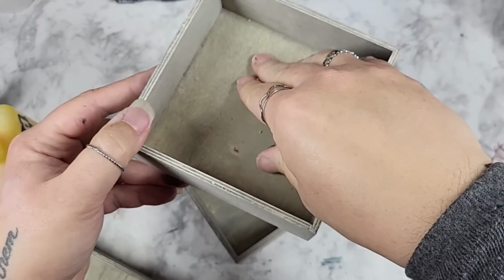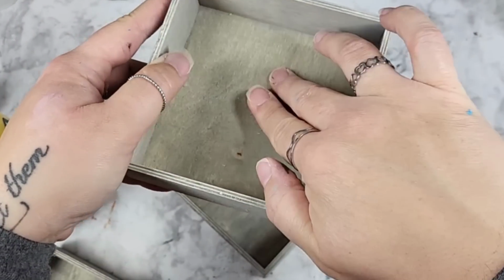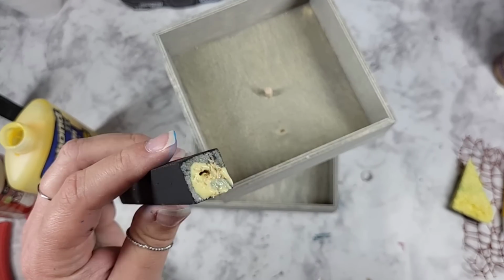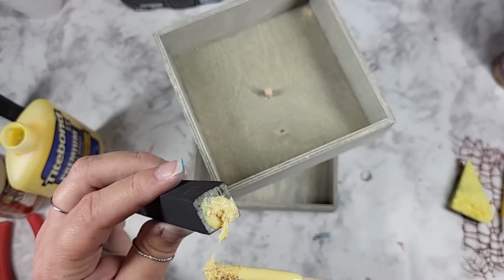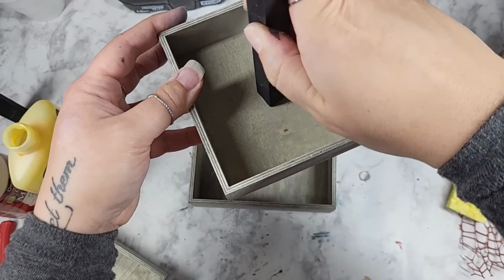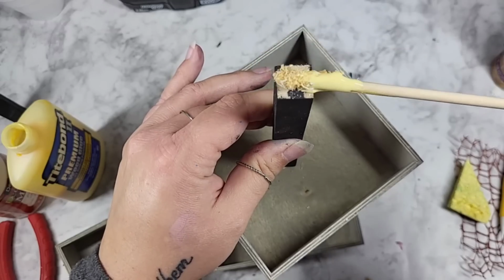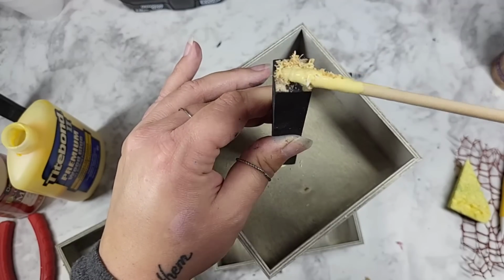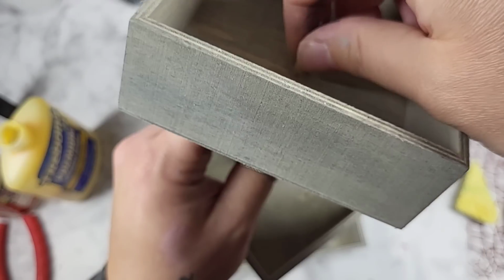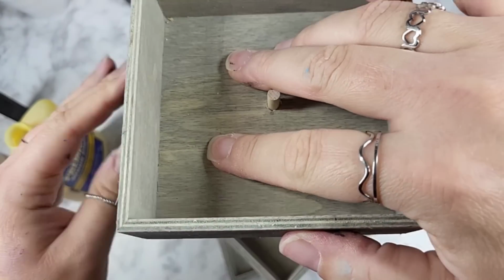But on a serious note, adding some little wood chips or little wood bits, your sanded pieces, into holes whenever you're doing stuff like this, it's going to seal up anything that might have a gap and just blend in with that wood glue and your dowel. So once it's sealed, everything is tight in there. There is no air gaps, allowing for possible breakage. So people, you know, gather all your little sandy bits up whenever you're doing projects like this. You never know what you could possibly use them for.